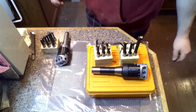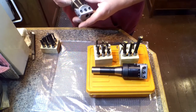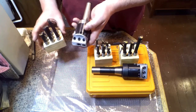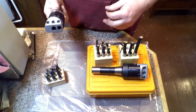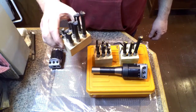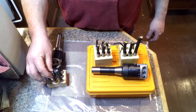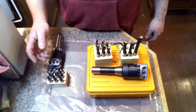Okay, another tool review. Three or four years ago I got a little Grizzly mini mill that takes an MT3 taper, and I bought this little boring bar set. It was terrific at the time — used it many times, abused it many times. All the carbide tip boring tools are in good shape. I'd sharpen them with a little diamond file saw blade sharpener I converted to sharpen carbide tips, and I've been very happy with it.